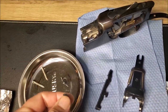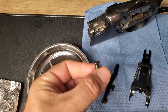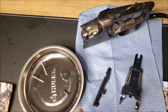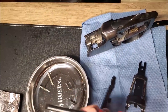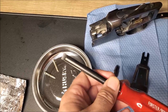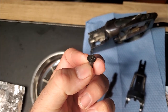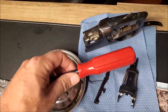When dealing with a lot of these old guns or European guns, you'll notice they have very thin flathead screws that require a special screwdriver. I really don't recommend grinding down a normal screwdriver to make it fit — it's best to buy the right screwdriver, a good hollow ground one. For this Satori, all the screws took a Forster number 10, and that's the correct tool for a job like this. I've even seen guys try to wallow out these screw slots with a Dremel so they can get a standard screwdriver in there — but don't do that. Just get the right tools for the job.